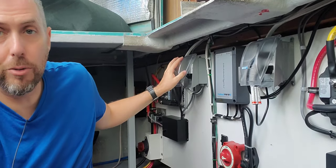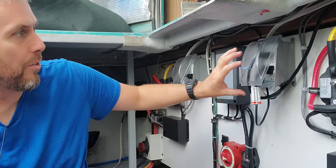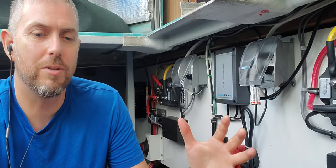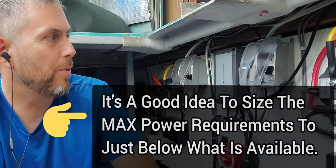From the AC panel, each breaker switch is wired into its corresponding GFCI outlet — here is the port side outlet and here is the starboard side outlet, both in outdoor enclosures from a hardware store. On the starboard side I have the starboard charger and also the house bank charger. Even if everything were drawing maximum power simultaneously, I'd still only reach 95% of what's available from the dock.